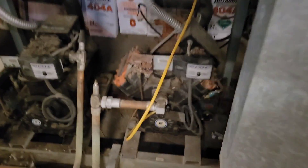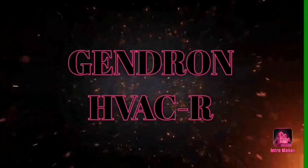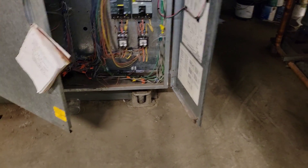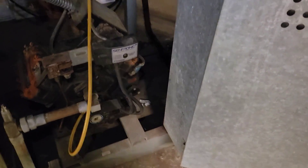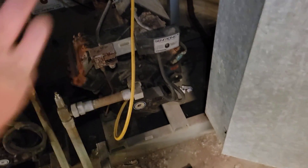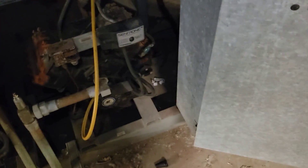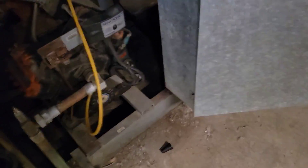How do you check a compressor and make sure it's not going to explode when you turn it on? Someone was on call last night and doesn't know why this compressor isn't doing well, so we need to figure out if it's okay. First and foremost, I have no way of knowing if this compressor is filled with liquid or oil. For all I know, the controls could be garbage, it could have been shut down for six months and now filled with oil. The oil reservoir was empty before I started, so the compressor may have had oil in it when someone tried starting it up.